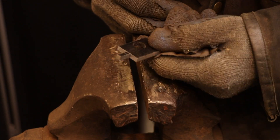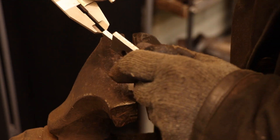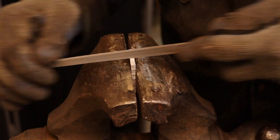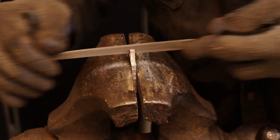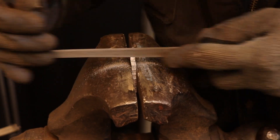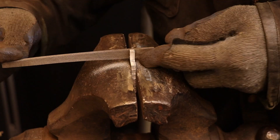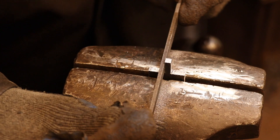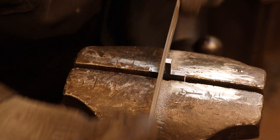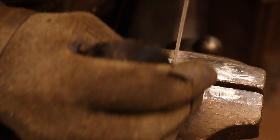I'm going to be making the screw that locks the divider settings out of a thicker piece of bar stock. I'm going to start by cutting in a square pin that's a little bit larger than I need for the screw that I'm after. I'm going to be using a pair of dial calipers locked into the setting that I need for the outside diameter of the stock for the thread that I'm cutting. I'll make sure that the square pin is exactly the right size, then knock off the four corners to start creating an octagon, making sure those flat faces are also exactly the right size, and from there it's pretty simple to just create a round pin that's very close to what you need.